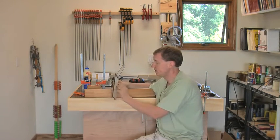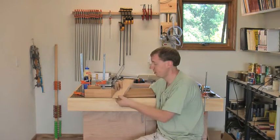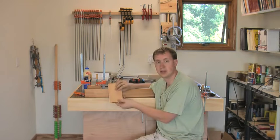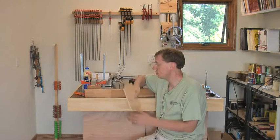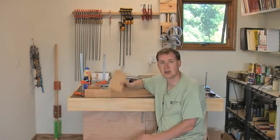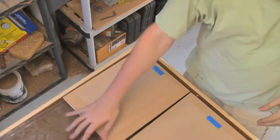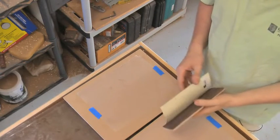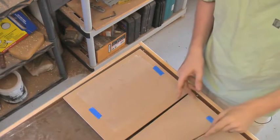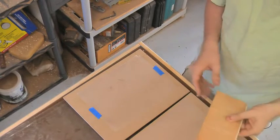So that way we'll get this light, dark, light lamination. I think this will contrast really well with the ebony fingerboard. So while this dries, we're going to grab the vacuum bag and throw these in the vacuum press. I've got my 2 cauls here, my vacuum bag's back here, and my 3 veneer pieces. Hooray! So let's get some glue.